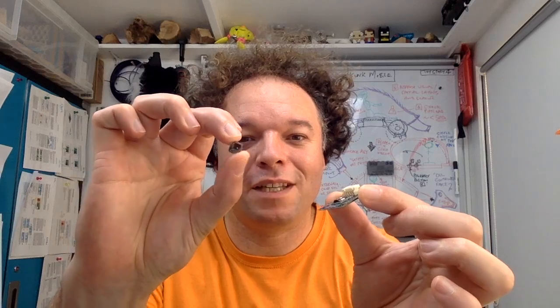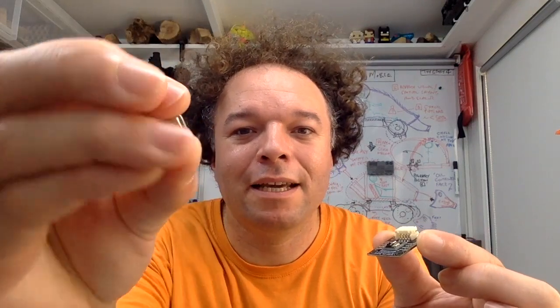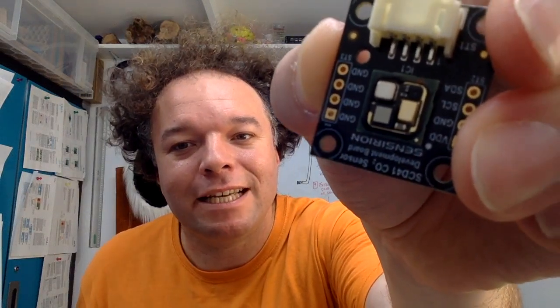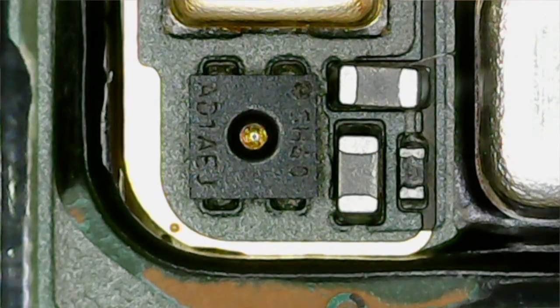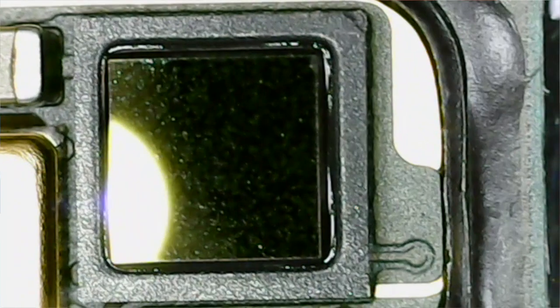I basically chipped off this little top bit, and it's quite interesting to see that that's the little hole, and then the white thing on top is the membrane that allows the gas exchange to take place. And what's interesting is if you take a closer look at this, you can actually see this tiny little temperature and humidity sensor in what will be the bottom left corner in that example. I found this quite fascinating. And then if you look in the top right hand corner, the extremely shiny glassy looking thing almost looks a bit like a CMOS sensor. That is the infrared sensor that's doing the intelligent bit of taking the readings. So you probably don't need to know that, but I found it interesting just to hack it apart, and it actually gives you some insight into how these sensors work as well.